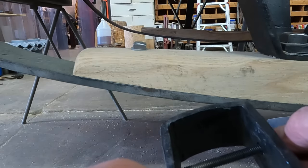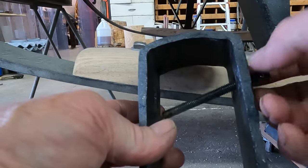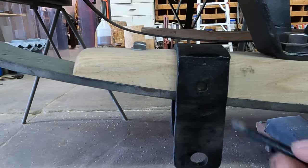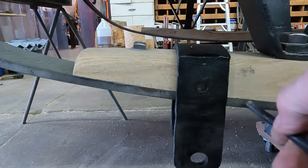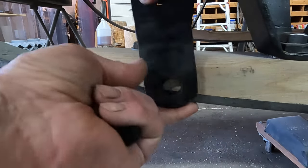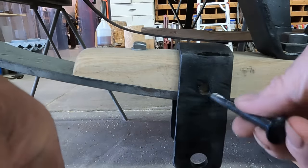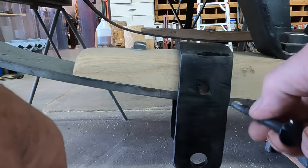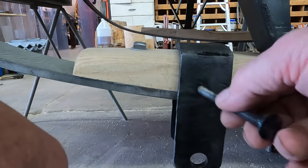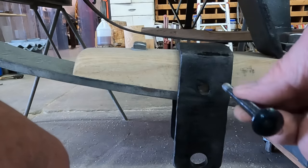So this is one of those irons where you can see how crooked this bolt is. Well, this is the higher side, so it's the shorter distance here. If I put it on in this position, you can see this bolt is just going to clear this ironwork on the bottom of the rocker. Well, if I turn this around, the hole gets even closer yet, and on a couple of these, it actually will hit that iron. So on 3 out of 4, I need to weld this hole shut, and it needs to be moved up more into this area to where these bolts run straight across.